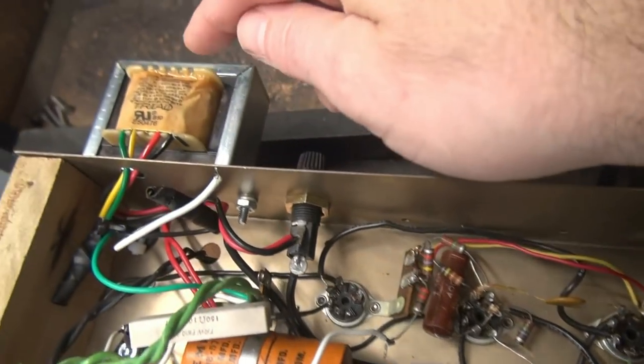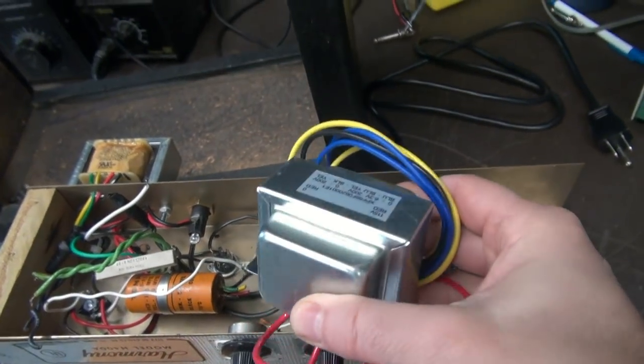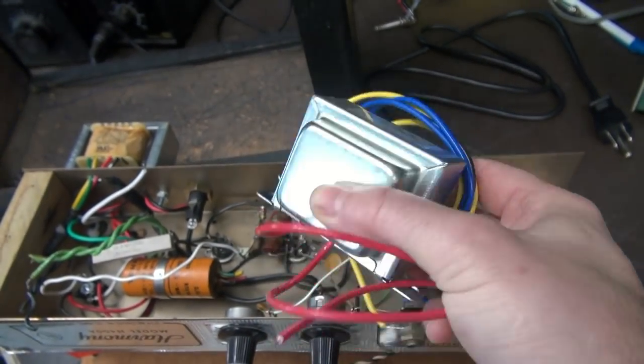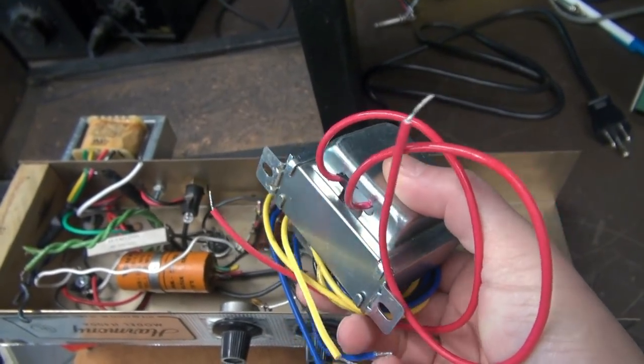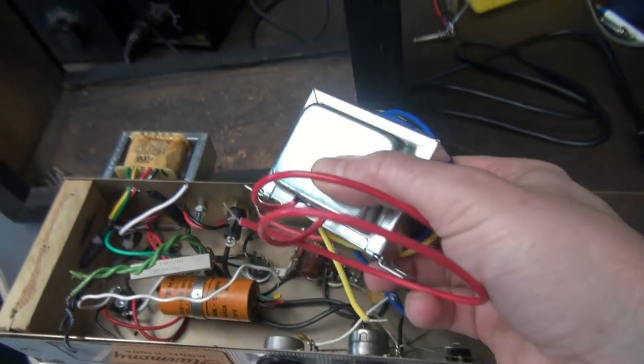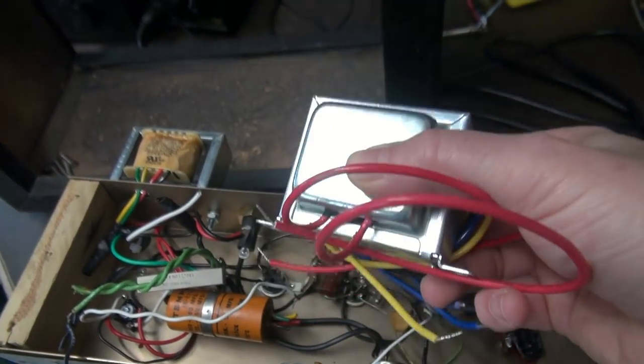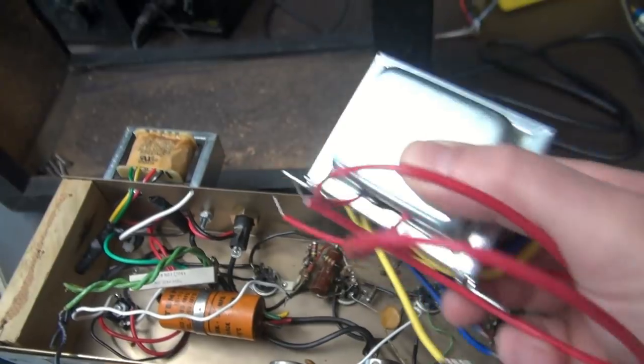What I'm going to do is remove the triad, and in its place I've got this power transformer here. This is a routine transformer that I use on little 6AQ5 amplifier circuits and it works beautifully — it will mount right in that place. So first step, I'm going to carve this stuff out, mount this up, and start wiring it.